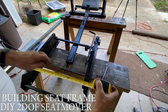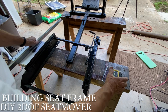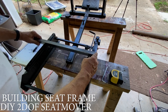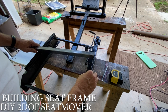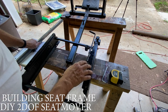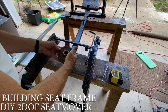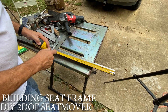I'm gonna measure out 17 inches right here — that's what I'm gonna cut the inch square tubing to. I'll put one right here and one right here on the bottom of these pieces. We'll take these back off, weld them up, and that will be where the U-joint's gonna sit. Right at 17 inches.